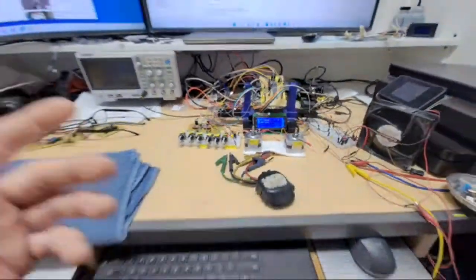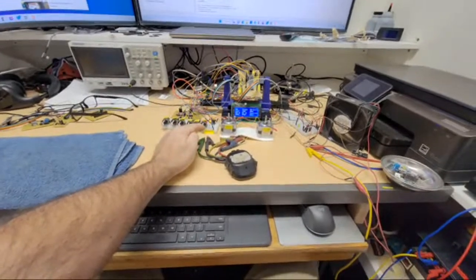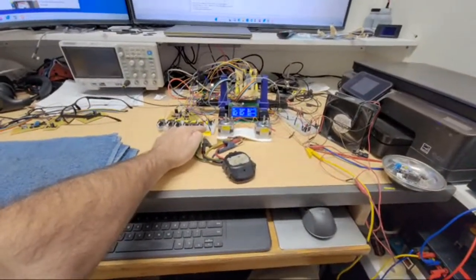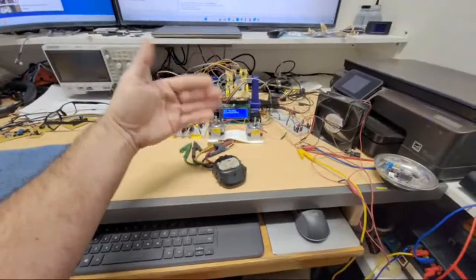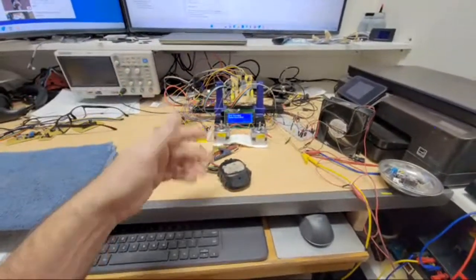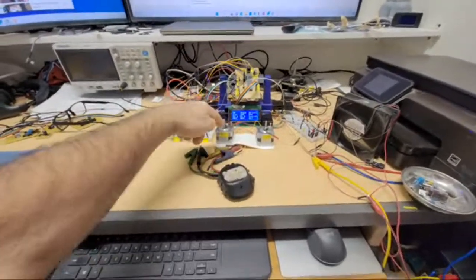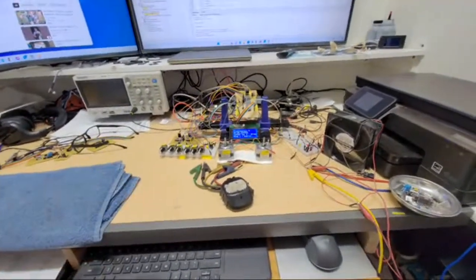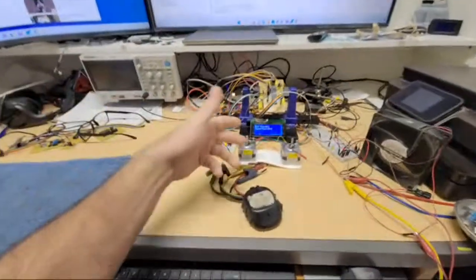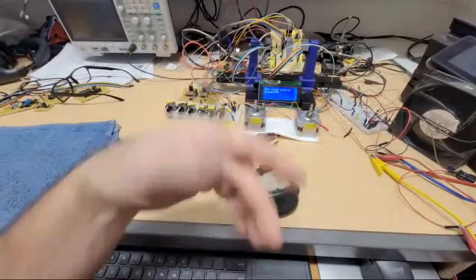So some of the changes as it's changing modes only change whether it's going to reject heat into the water heater or not. So it's going to turn on the pump, turn it off. Some of them are switching to where it needs to go. Okay, don't cool the room anymore, and it's going to switch to the outdoor expansion valve. And at this time of year, right now, it's pretty much just going to be using the outdoor one and not really switching into hybrid.